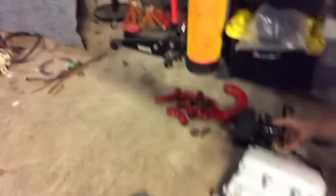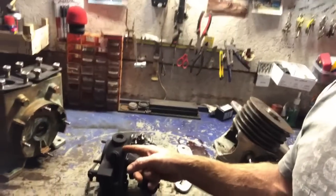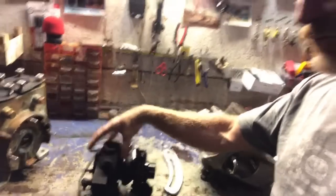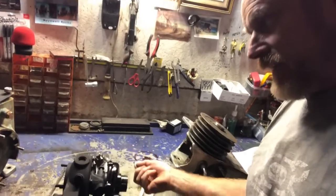We've got the turbo, and the turbo is an interesting one to look at because we've painted it. You can see this side looks kind of dull — it's got high temperature paint on it because this is the side that runs on the exhaust and it's going to be very, very hot. This is the compressor side and it's compressing the air.